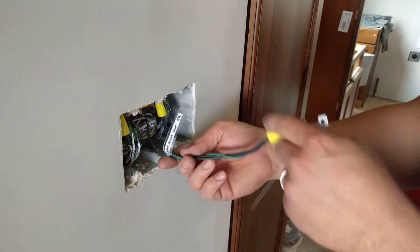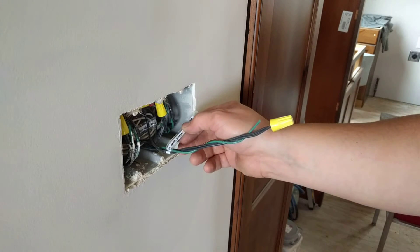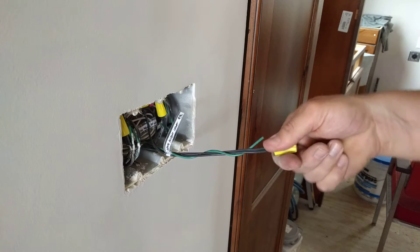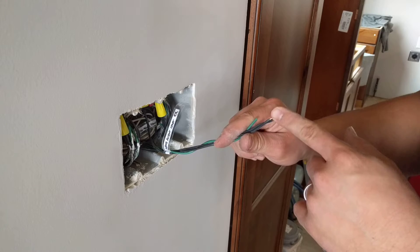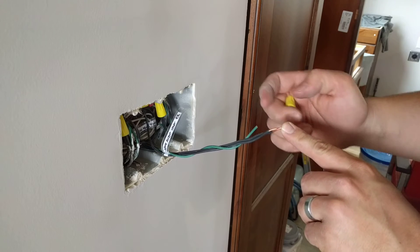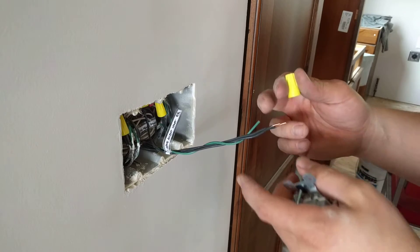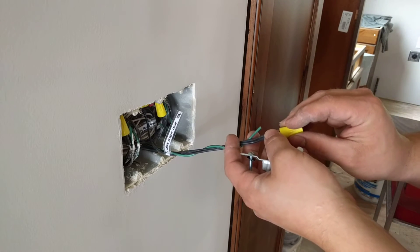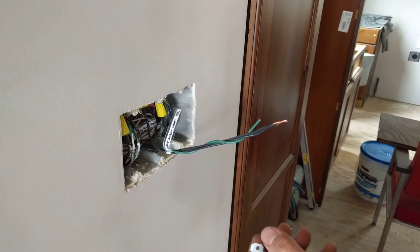So this is how I prepared the box. When I was roughing in the wires, this was my method to keep them all together. I have labels on the wires letting me know where they come from and go to — basically we have power coming in on one leg and power going up to the light. Now obviously before you do this you're going to want to make sure that you get your power turned off — I have already verified that, so we're able to proceed. The reason these copper conductors are twisted together here is so the switch was effectively already turned on, so I could use temporary lighting and verify I don't have any wiring issues. I connected everything, turned it on before the sheetrock was done, and left the circuits on during the drywall process so that if they were to run a screw into a wire I could find out as soon as possible.